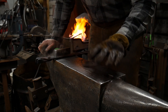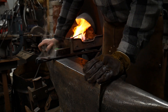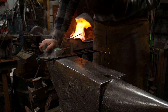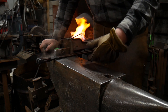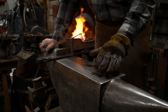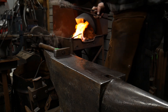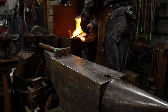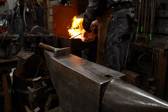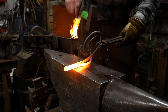If this doesn't weld — I want to put this out there — if it doesn't weld, you can always go back, put it back together, set it together, hold it well, make sure the pieces are clean and are not burnt by oxygen. Come back in, bring it up to another welding heat, and make a weld. Don't freak out because it just didn't weld the first time. That won't make any difference whatsoever.